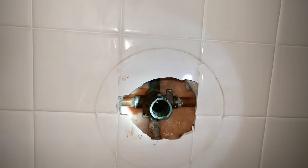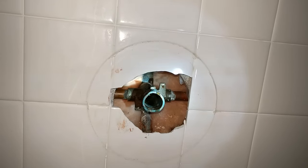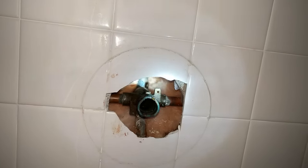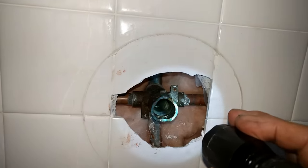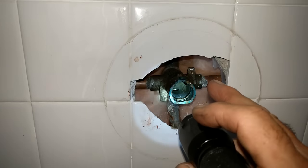It took me three and a half hours to get that out. You've got to clean out the receptacle where the new cartridge is going to go in because it's going to have hard water deposits unless you live somewhere where you don't get that, and you want all the rubber gaskets to seal. So I'm going to use a piece of light sandpaper — very light and very easy — just with my finger to reach in there and brush away those hard water deposits.